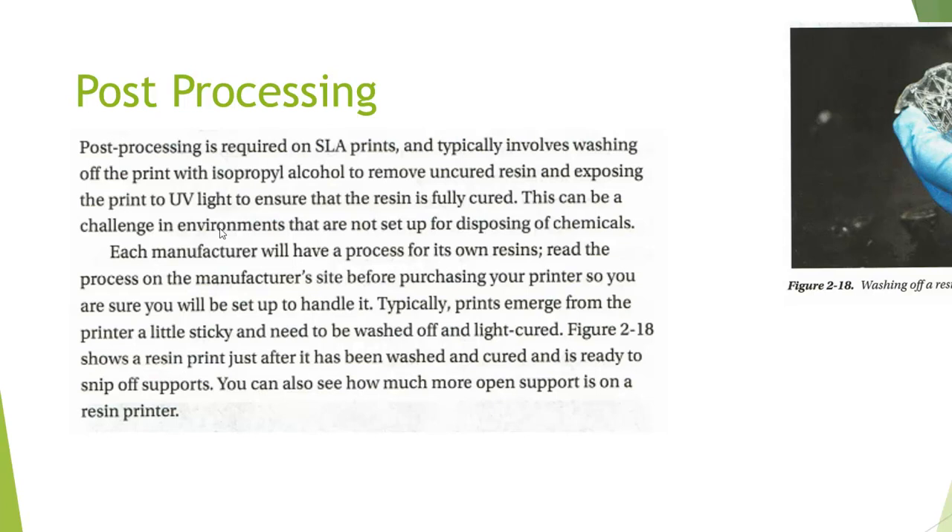Post-processing is the things that you do to the 3D print after you have created it. Oftentimes it's removing the build plate material or the support material. It takes time — it's kind of therapeutic — but that's why people will go into dual extruders with soluble filaments and get a part tank where they don't have to do as much post-processing. Right now we're just 3D printing, but there's all kinds of things as far as how you would take that completed 3D part and prepare it for presentation quality, prototypes, or for parts that you would actually use for production.